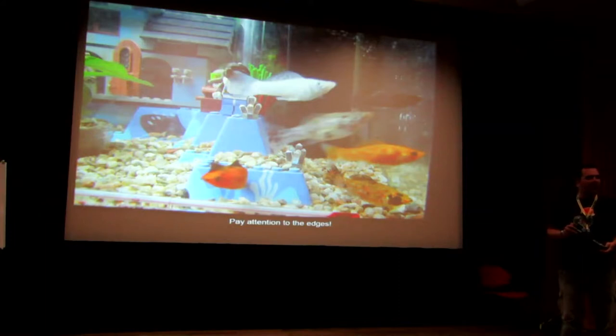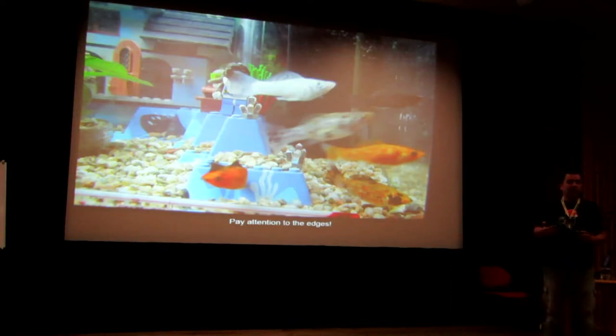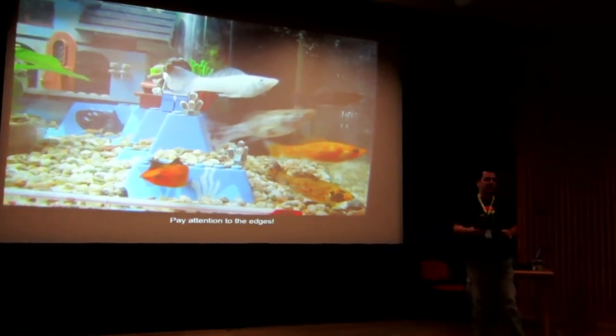Every time touching the submarine before using it. Yes, it's a proof of concept I did. I wanted to see whether it all works well, but it didn't actually help much because the mass that the electronics bring with them, the battery pack particularly, changes the balance so much that you cannot test it properly before you really try with real weight and real distribution of weight. But yeah, in theory, pneumatics should work. So, for example, if you've got several manually operated pumps outside the water and get the hoses inside to control the submarine, it should work, yes. And then you don't even have to worry about the air pockets and such things. But then it's not completely remote anymore, you've got the hoses.